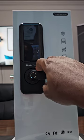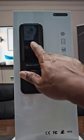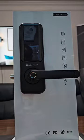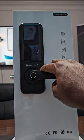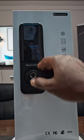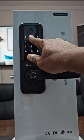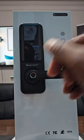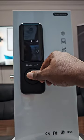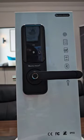Okay, and now to select 5, 10, 15 or 20 seconds, what you do to select how many seconds you want it to auto lock is you first unlock it. Okay, and then at that point, when the screen comes back, the zero stops, you touch the screen quickly, and you hit two and you hold it. That will be 10 seconds. So count. And over here, I will unlock it.